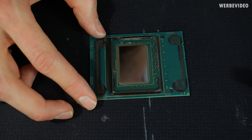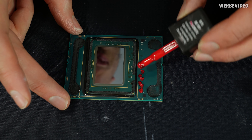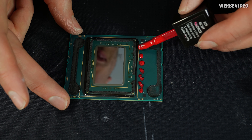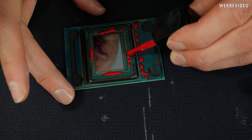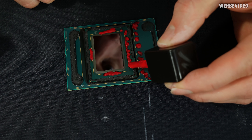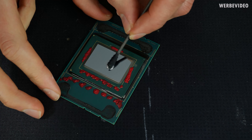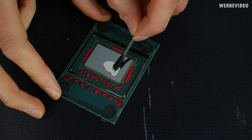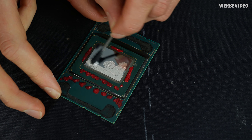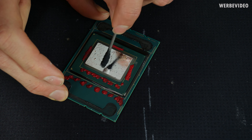After cleaning the CPU, I used some of Mary's nail polish — the red one — and covered all the SMD parts with nail polish first before removing the glue residues from the top PCB. Similar to what I did with high core count CPUs like the 7980XE Skylake-X, I do this because it protects the SMDs from liquid metal, and with the additional stability it's much less likely that you accidentally remove SMD components while scraping off the glue.